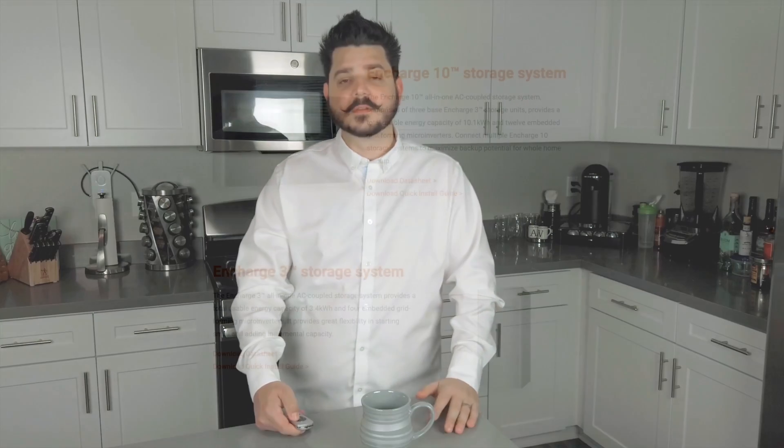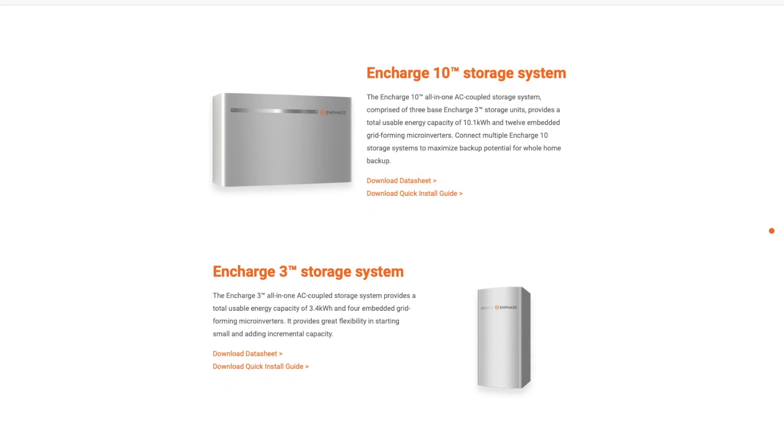While I'm a huge fan of the Ensemble system, it doesn't come without some drawbacks, and that's the Encharge batteries. Let's look at the pros first. The Encharge battery is modular and starts at 3.3 kWh of energy. You can connect three battery cabinets together for 10 kWh of stored energy. Each Encharge battery is powered by four specifically developed IQ8 microinverters that are hot-swappable, meaning we can replace them if one goes bad without replacing the entire battery unit. And if one goes bad, your battery continues to operate with the other three micros. The battery chemistry is LFP, or lithium iron phosphate — very stable compared to lithium-ion and with a much better life expectancy.